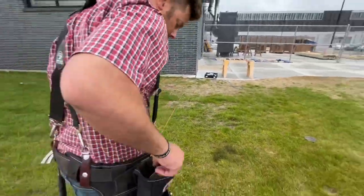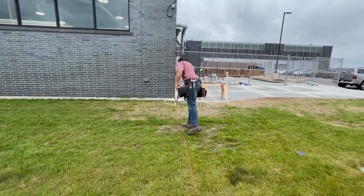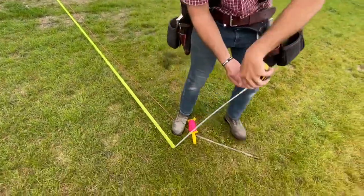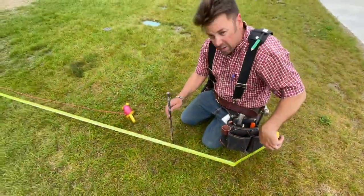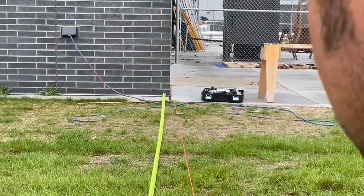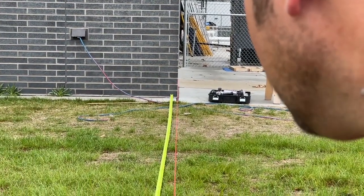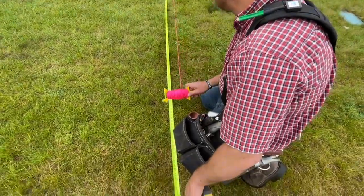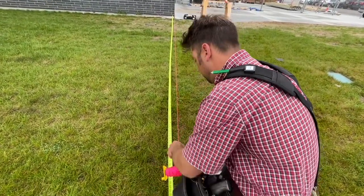If I know how far I have to come out, I can also stretch a tape off of the building. For demonstration purposes, I'm going to come out 20 feet — that's about what we should have built this shop to be. I'm going to set my pin here close to it. Look down the line with me: as I pull this tight and touch the building, I am co-planar, meaning the line is parallel with the building edge. I can bring this out to 20 feet and touch the building.